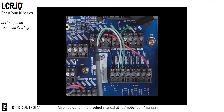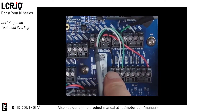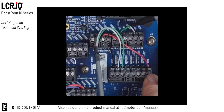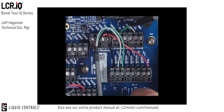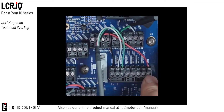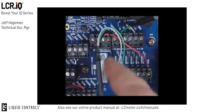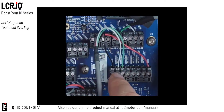If we open the door to the IQ and zoom in on the main I/O port, you'll see our cable coming in from our XL display, plugged in here to our terminal block for our digital outputs — pins 63 through 70. Our red wire, which is our plus voltage going to our display, is connected to pin 70, which is VP or plus VP on the I/O port, supplying voltage out to the display. And going to pin 63 is our DC ground on the black wire, providing power and ground to the display.